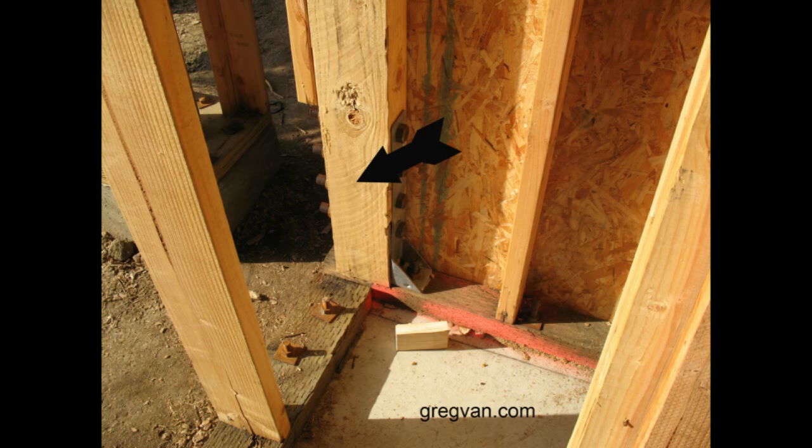I have run into a lot of builders that just look at the plans and build, and if it's on the plans, they just go ahead and do it anyway. But this is a problem that these people are going to run into — the fact that for these HDs, the hold-downs, the larger ones will require minimum sized posts.